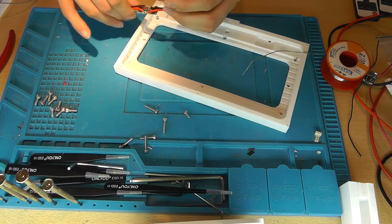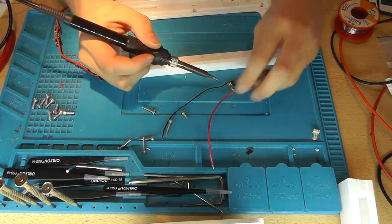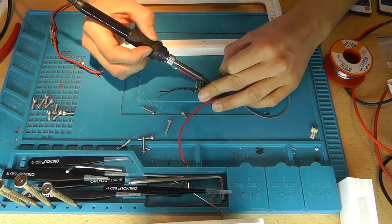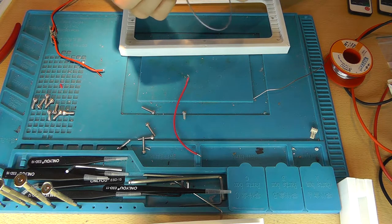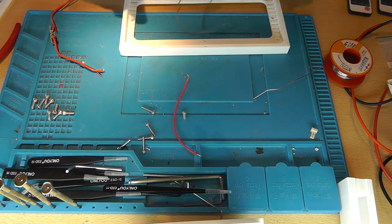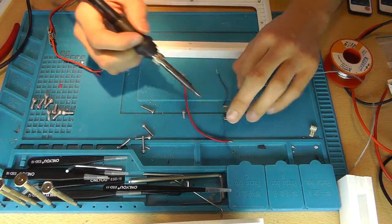Well, since this has heated up, let's remove the wires from the LED, like so. Now, that went a lot smoother than last time, as you saw. Now, this one is good, and this one needs to go. Right, and grab the new wire. Now, this will convert your 24 volt to 12, or to the voltage that you actually set to, and it will allow you to attach a fan.